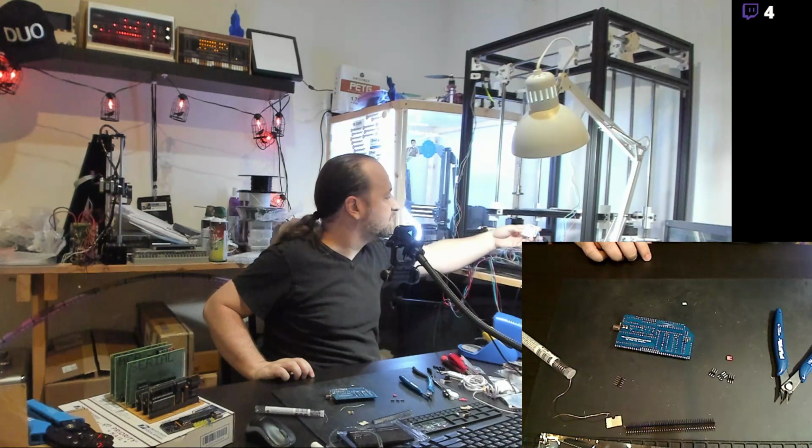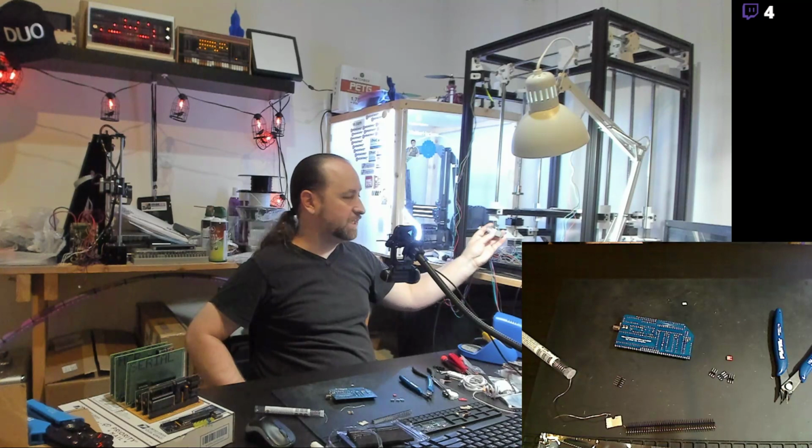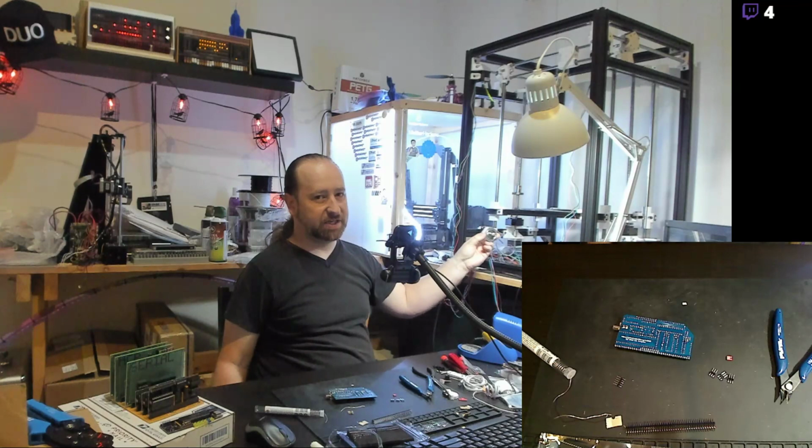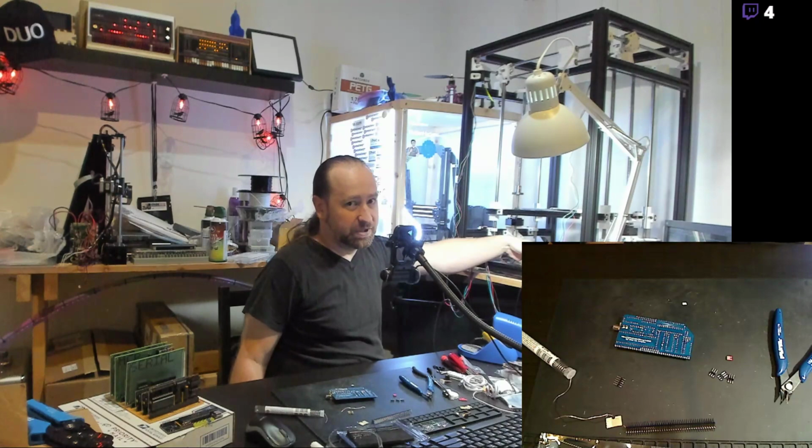Here's this is a pancake extruder motor that I'm using for the Bontech BMG geared extruder. This is a Lin Engineering 0.9 degree super high torque pancake motor. These things are phenomenally smooth. They're also expensive. This one stepper was $48. However, I wanted to build a really nice Hevo. I didn't want to skimp on it, so all my steppers are actually high quality,